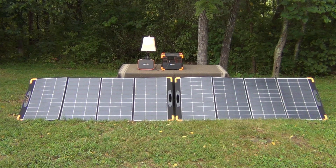This uses the LiFePO4 battery, which is a new technology. It can run up to 3,500 charge cycles and still retain 80% of its charge. A lot of batteries have maybe 500 or 1,000 charges before they lose their ability to hold the charge very well, but this one — 3,500 cycles. If you do the math on a 365 day year, that means you can run this for nine and a half years. You can use it at night, run your electronics, put it out the next day with the solar panels and charge it right back up to use again the next night — every day for nine and a half years.